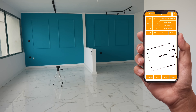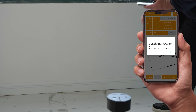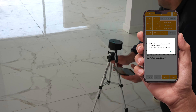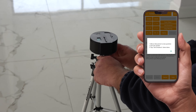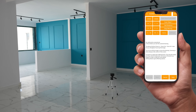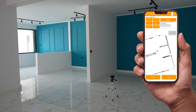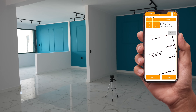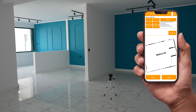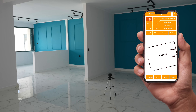We will do it one more time. Tap next scan, then sticker and align. Mark the sticker and tap get distance. When prompted, and only then, move the 2D scanner to the new position. Aim the sticker and tap get distance. Scanning has started. When the line is detected the scans will be aligned. We will scan this corner now. During the scan you can zoom in and out in the drawing.